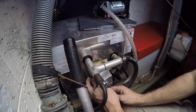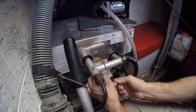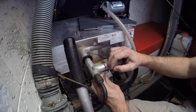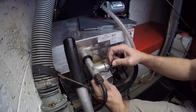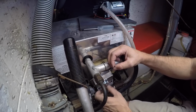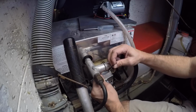So I'm looking at this run now, and this is another one of those, like, where do you draw the line on your repair? You start tearing into things that aren't technically broken, but are not to a current standard either. This is a multi-strand copper wire. It's not tinned, so if they're subject to corrosion, should be replaced with a marine grade tinned wire.